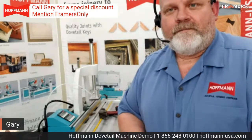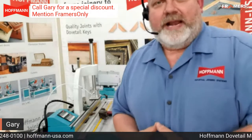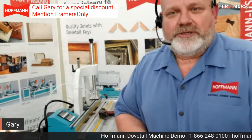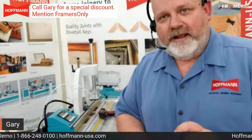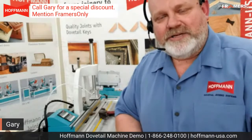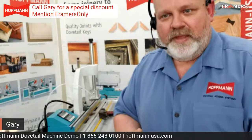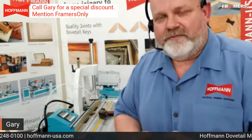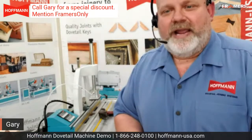There's a question here — are the decorative keys made out of wood? We do have keys made out of wood, but those are purely decorative, there's no structural point to those keys. A wooden key is an inlaid key — so say you route in something one inch deep, we would have you put in a five-eighths inch plastic key first for alignment and strength, and then the wooden key is purely decorative. We have people that put a maple key in an oak door, or a wenge key in a maple frame. It gives a true craftsmanship look, but you cannot use a wooden key for strength — you need to use it in conjunction with a plastic key.